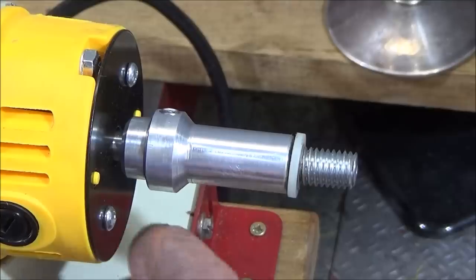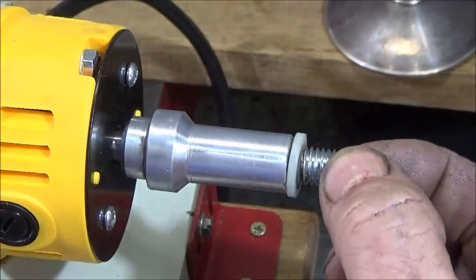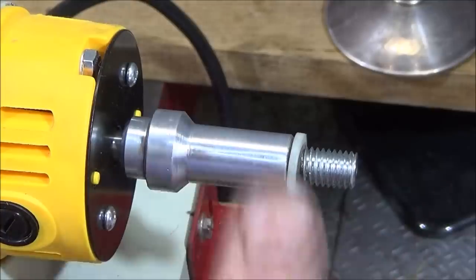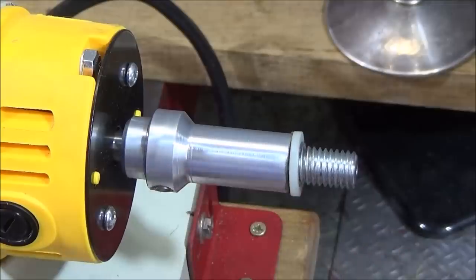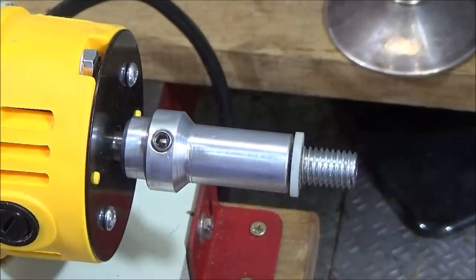from end to end. So do all the drilling right the way through with the 8mm drill first. So when you turn it round to do the threaded end here and bore that out or drill that out and tap it, that thread will run nice and true within the adapter. And obviously you have to have it running pretty true, because the polisher is running at a very high speed and anything out of true would make it vibrate a bit.